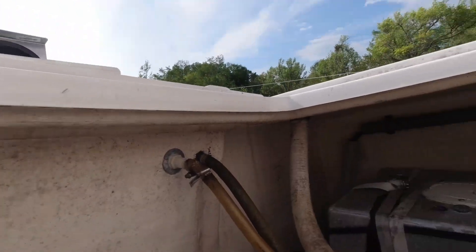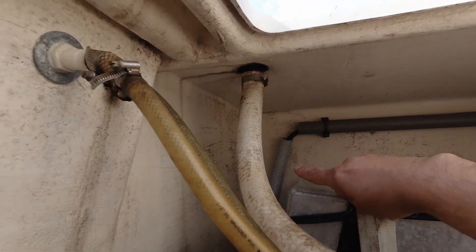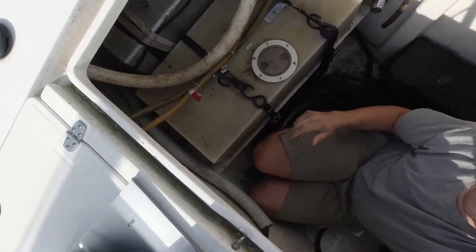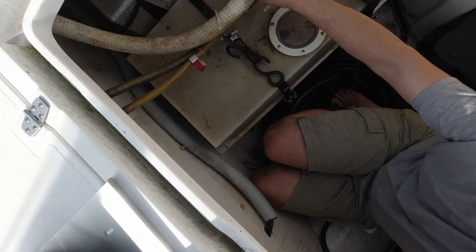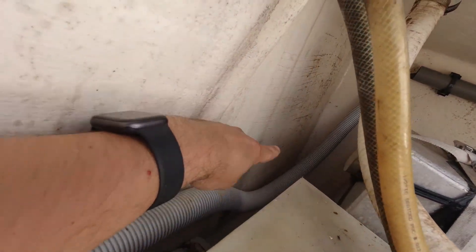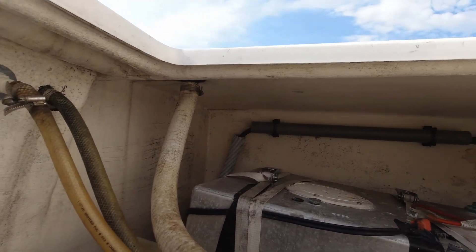This is turning out to be like just another boat project — more involved than you think it's going to be. I'm going to install this ClearSource Marine onboard water filter back here on this wall. This is the waste holding tank — it's going to come out — and this is the pump-out hose, also coming out. This is where I'm going to install our water filter. It's going to tuck in nicely right behind the water tank. I should have plenty of room down here to change the filters, and I think that's going to be a good tucked-out-of-the-way location for our onboard water filter.